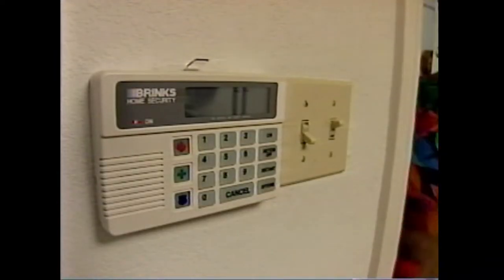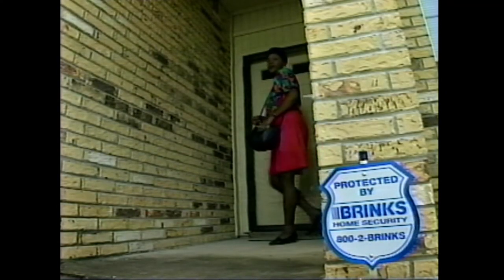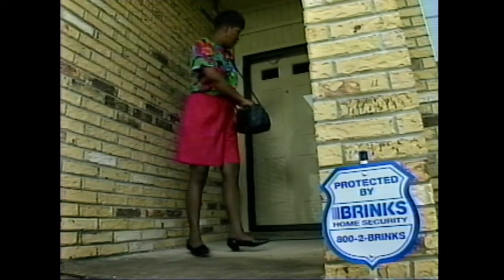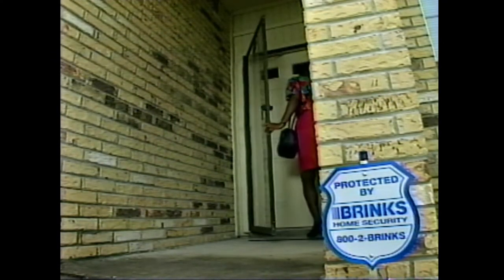If you're unable to exit before the delay period expires and the red on indicator light stops flashing, you must turn the system off and start over. If you exit and need to immediately re-enter, turn the system off, even if the exit delay time has not yet expired. When entering your home, you must enter through a designated delay door to avoid an instant alarm.